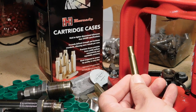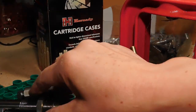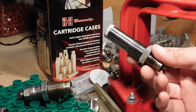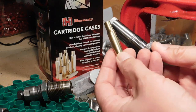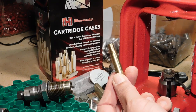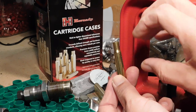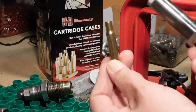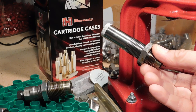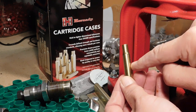What Richard Lee did — and he's got a lock on this — is that he has a collet neck sizing die that allows the squeezing of the neck for our bolt-action rifles to get the specifications we need without causing any stretch. That's why no lubrication of cases is necessary with this die. You get no stretching or deforming of the case.